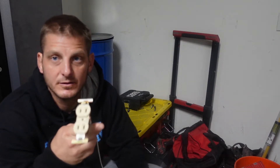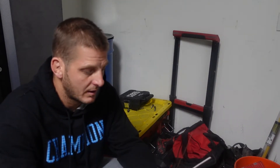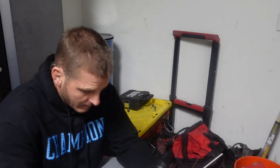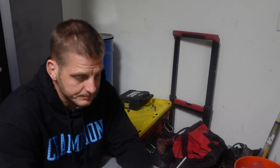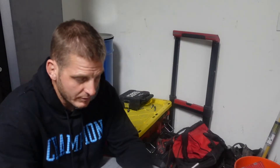If you have ugly old two-prong outlets with only a two-wire setup and a plastic box, be careful, because you may be putting yourself in a bad situation. The only option isn't just GFCIs — you can also run an equipment grounding conductor to each one of the boxes. There are rules for that under NEC Article 250; you'd typically run it from the enclosure or panel board to wherever you need it.